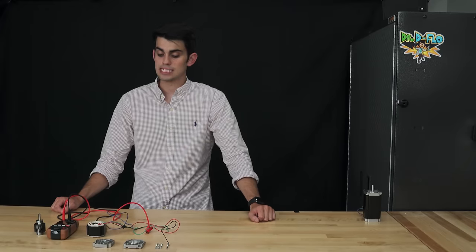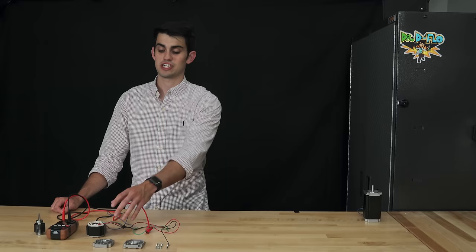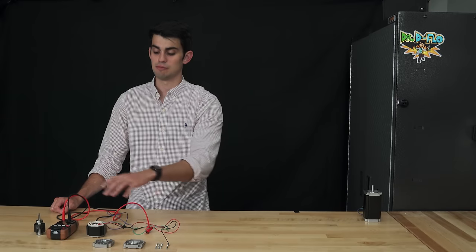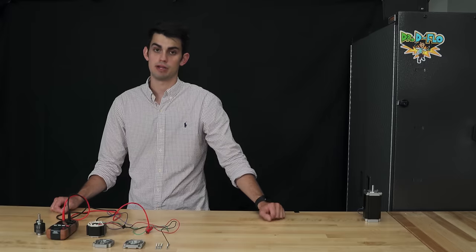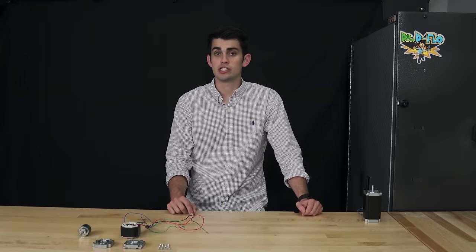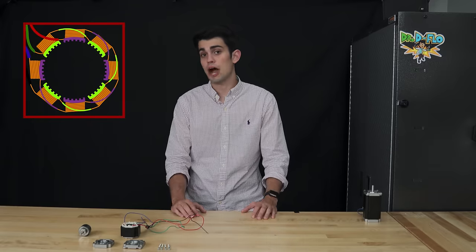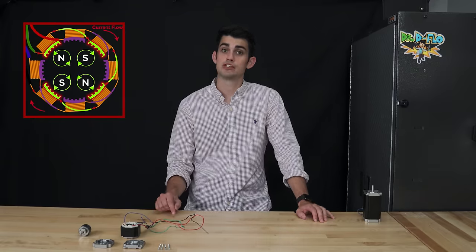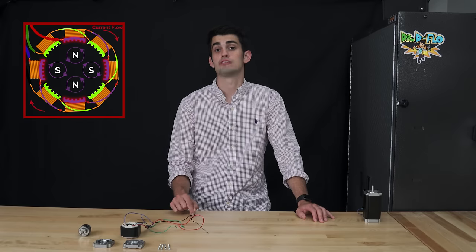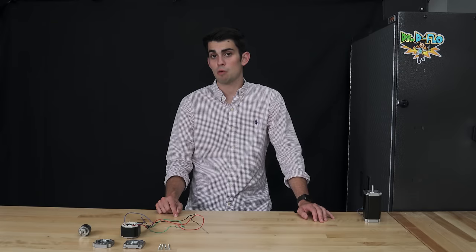I always recommend when you buy a stepper motor to check which wires belong to which phase. You don't actually have to open up the stepper motor to do this, you just need a multimeter. You'd be surprised how the color schemes differ between manufacturers. I am providing a lot of information here, not for you to memorize, but to emphasize that the way in which a stepper motor is wired and eventually connected to the printer motherboard is important, mostly because of the two separate phases and the direction of current flow and how that will affect the polarity of the coils. We will continue talking about wiring when we actually hook up the motors to the printer motherboard.